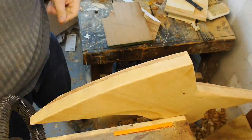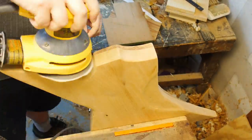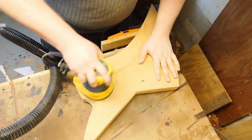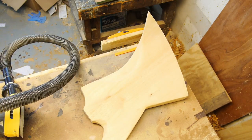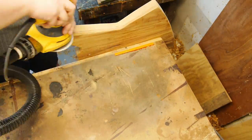From there, up to 120, 150, and finally 220 grit. I'll still need to do some touch-ups after patching the holes from the thicknessing misadventure, and sand the front after I route the cavities for pickups and drill the holes for the bridge and the tailpiece, but this at least gave me something to do.